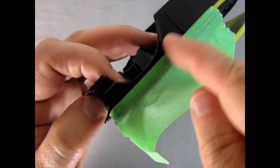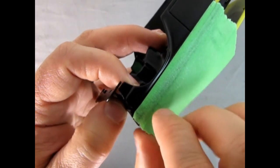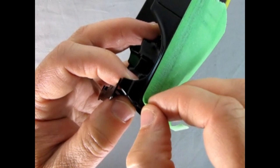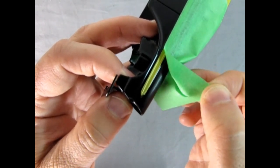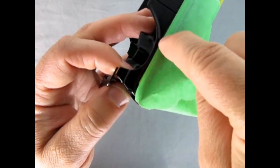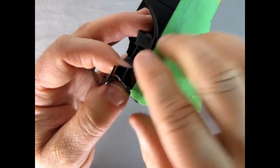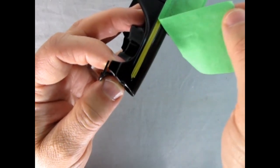After the second coat of paint is dry to the touch, the masking tape can be removed. Carefully roll the tape backward onto itself to remove it, because if you just pull it straight up you run the risk of chipping all the paint along that edge. The nice smooth roll will pull it back nice and evenly.